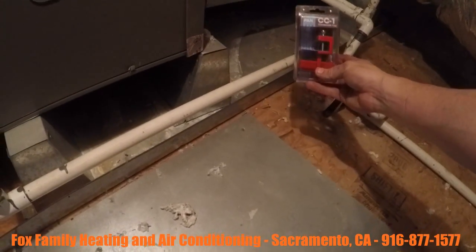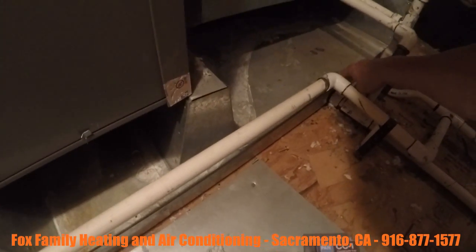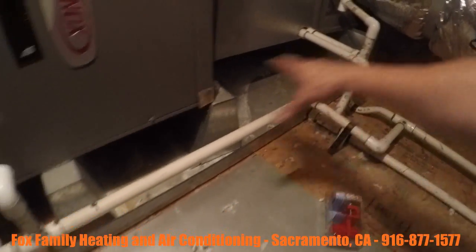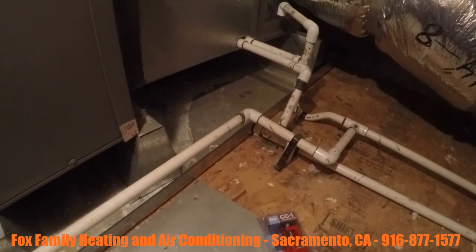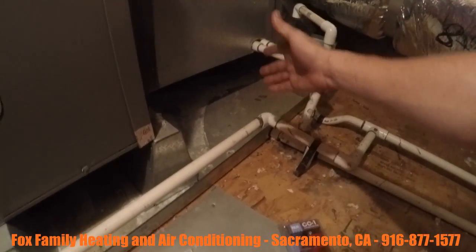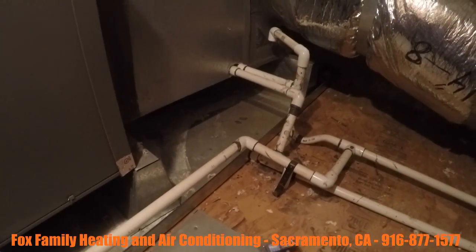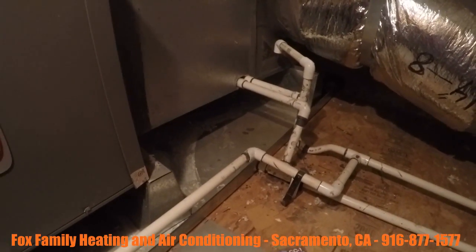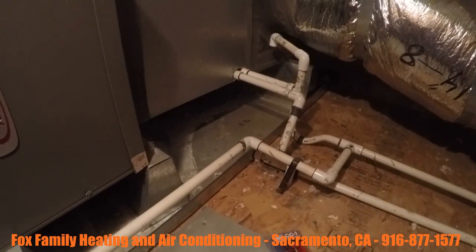For the purpose of this video, I want to talk to you about a condensate safety switch, and we're going to go ahead and put one in. This switch is going to mount on the side of the pan right here, because if this pan were to ever fill up with an inch of water, this switch will shut it down. It's wired into the furnace and it'll shut that system down, letting the customer know that something's wrong. I would much rather have the system turn off than have this pan overflow with water and go down onto the sheetrock below. This is a beautiful two-story home — the last thing this customer wants is a flood going down on his sheetrock.